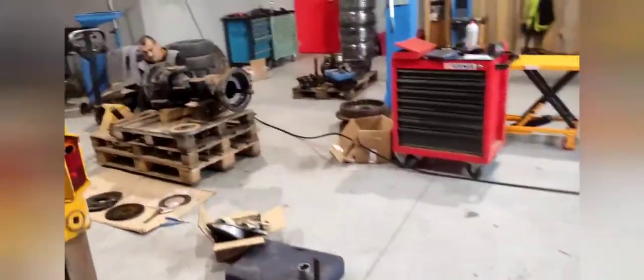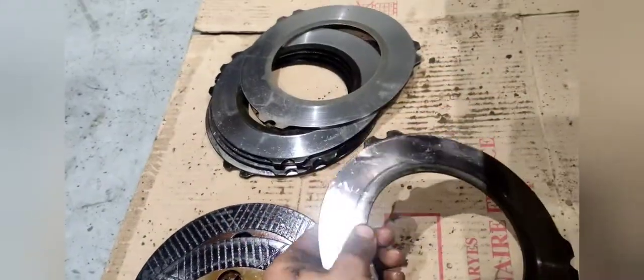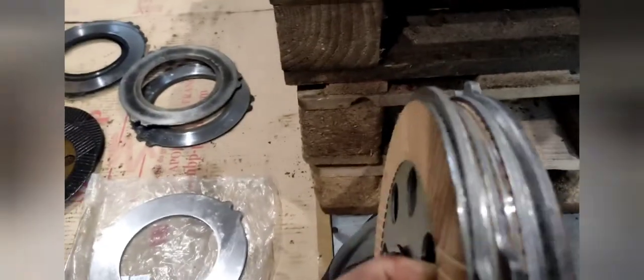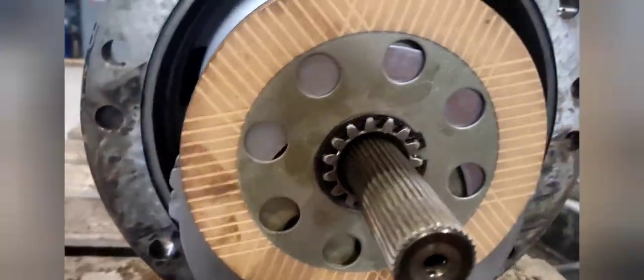About the brake discs on the left side — the metal plates were a bit more worn, so we'll replace them also. Full set on this side. I already installed the first one, and after that you just put the brake disc and in between there is a metal plate and you just push all that inside. It's kind of hard with one hand but I'll do my best. Now you have to align everything back up — and that's it.